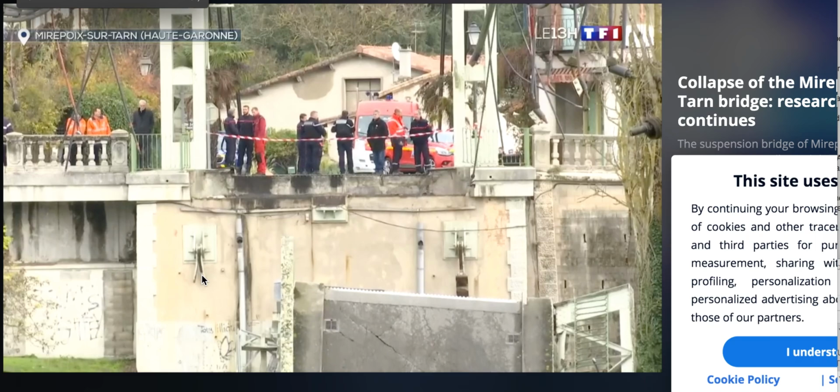So, and it's not much, what I'm saying, buckling, or it's not much there to present that. So that's part of that. That's a significant amount of steel to rotate two directions. So it bent out first, and then as it fell, maybe the pin pulled one side, causing that moment directional change. But what this is telling us is that it failed in the center of the bridge because it released downwards.